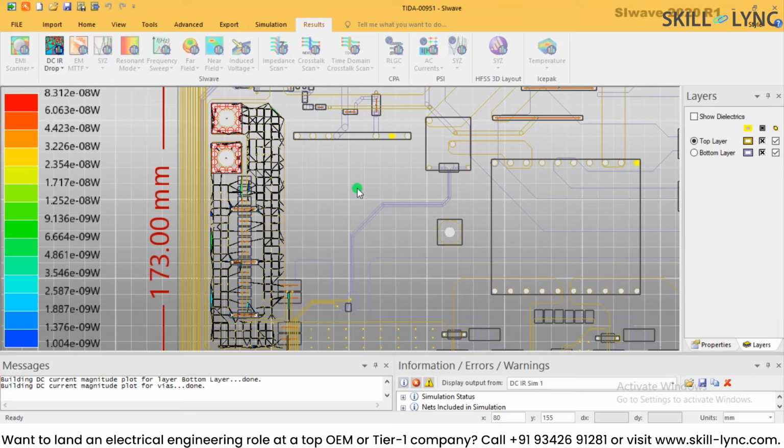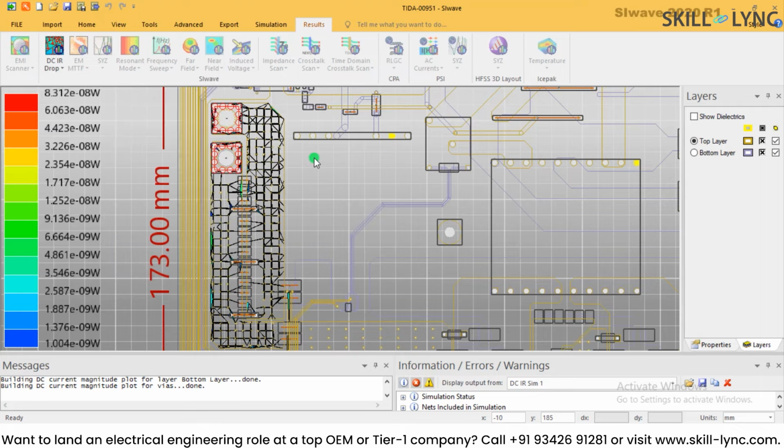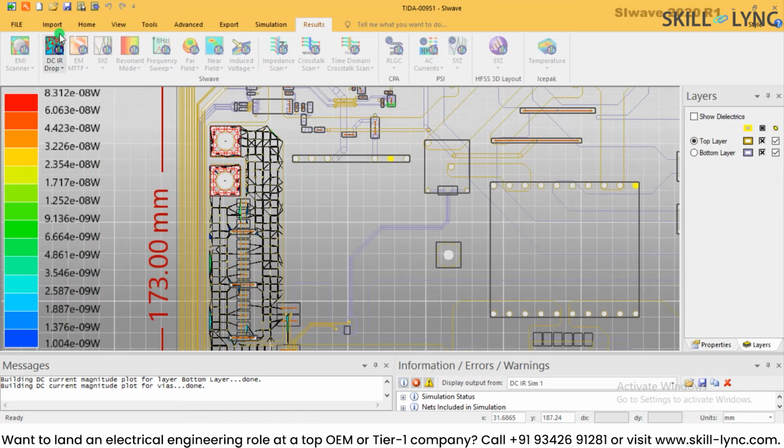Now let us switch to Ansys Icepak. You can export this to Ansys Icepak, open the same project, and check whether it's possible to have the circuit without cooling. You can analyze the performance of the PCB without any cooling or with cooling using Ansys Icepak. Ansys Icepak is basically the temperature and flow solver, and temperature and flow related simulations can be done separately in the Icepak tool. In SIwave, you can set up the electromagnetic related things.